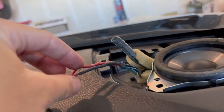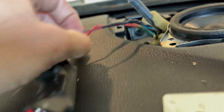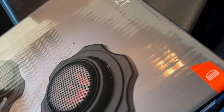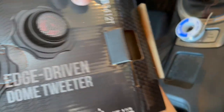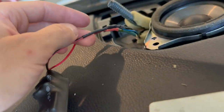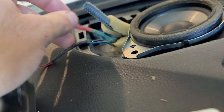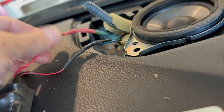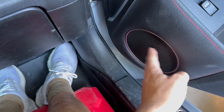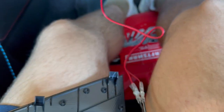I finally got these soldered together. I soldered the black wire and the black and blue wire to the black and red wire on this JBL speaker. I twisted the three wires together. I tried to put some green heat shrink on here but it ended up shrinking while I was heating it with the soldering iron. The yellow and the white and blue wires connect to the solid red wire, which connects to this right here. I did a function test — I turned it on and was able to hear the sound both from the existing speaker and out of the tweeter as well.